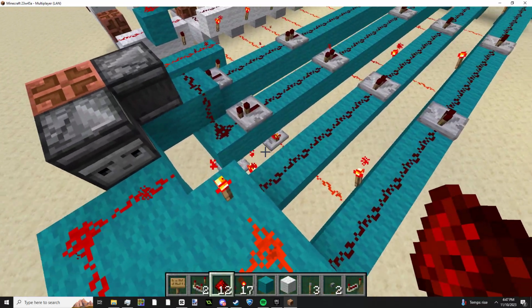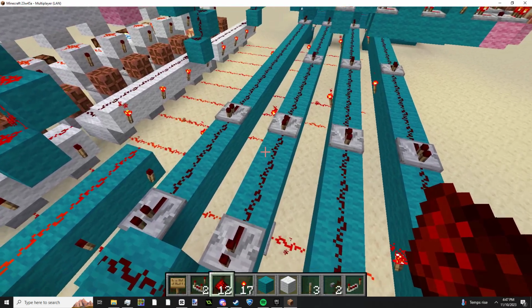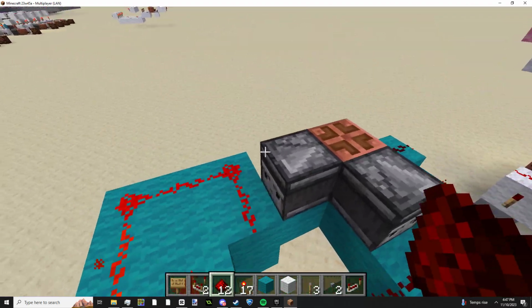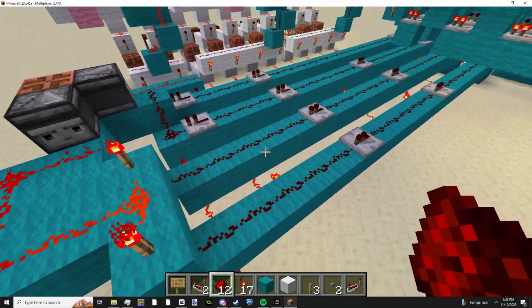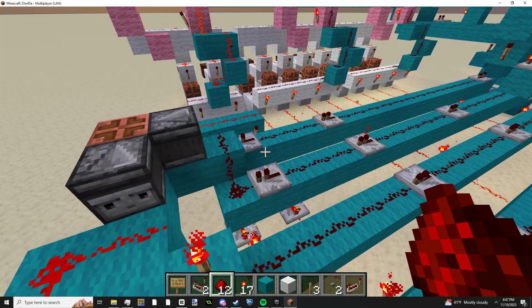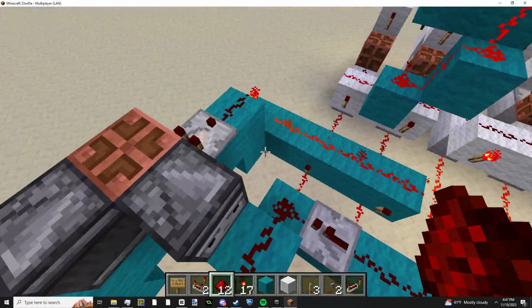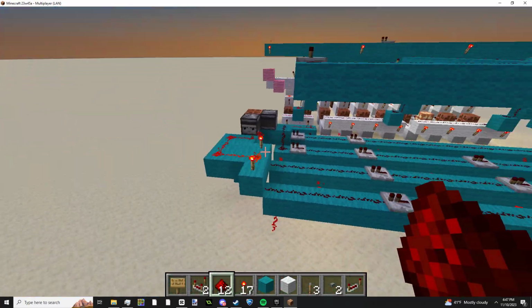I have the ones and the twos place ANDed, and then XORed, and then I have the 4 and the 8 on an OR gate that's XORed and compared. What this is saying is if both of these are on, we're going to get a number of 3. So we want to make sure it doesn't write to the memory cell if we give an input that's not supposed to be there. And anytime either of these lines is on, we also tell it to not write, which I think is a pretty interesting component.